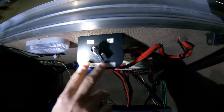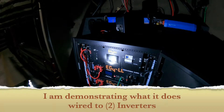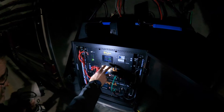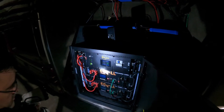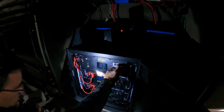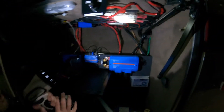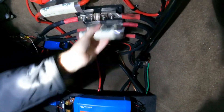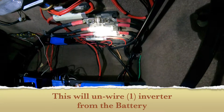I've got my 12-volt system here — it's turned off — and this is my battery system. I'll turn it on and the screen should come up. I turn it on and it says 'protection,' so there was a dead short. I'm going to turn that off, and I've got these fuses up here — this one and this one go to an inverter — so I'm going to pull the fuse from one and see if it'll start the other inverter.